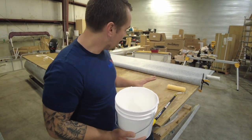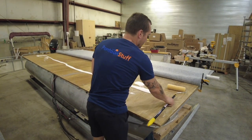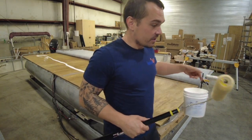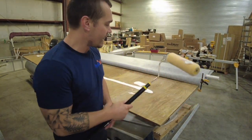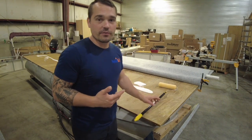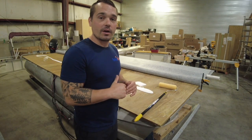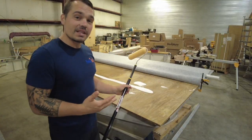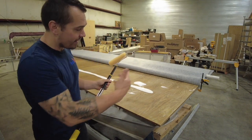On that first side, I do recommend adding a little bit of extra glue because it's going to take a minute for your paint roller to really start grabbing on. I'm going to put a lid on top of that glue can just so it doesn't dry out, because I'm going to be working on this for quite a few minutes — getting it spread, rolling our vinyl back, and then working it out with a PVC pipe and a cutting board. I'm going to roll it as evenly and uniformly as I can, covering the whole surface before I roll my vinyl back into place.